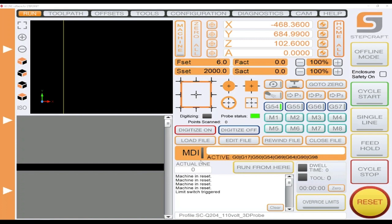To warm up your spindle, we're going to open UCCNC and reset our software. Note that this is demo software, so the reset is going to continue to flash. All you have to do is type in your MDI your desired speed — 50% is 9000 — so we're going to type S9000 and enter. Then we're going to start the spindle with our spindle start button right here, and we'll let that run for about 5 minutes.